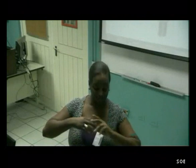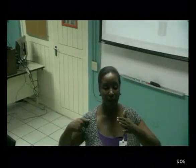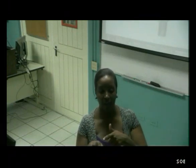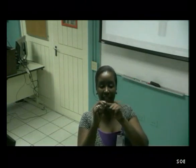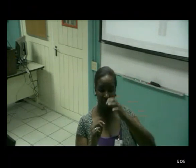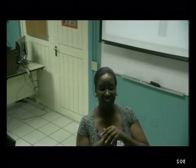Alright, remember what I said. Before you crimp it, you have to push the wire all the way up to the tip. When you look at it from the tip that will go into the network card, you can see the copper, all eight of them. Yes. You have to push it all the way in. Okay, we're trying again.